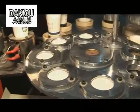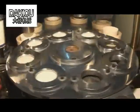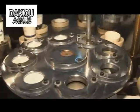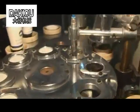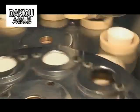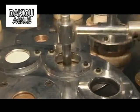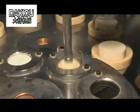The feeder roller transfers the fan-shaped paper to the positioner roller. The left and the right hinge hold the fan-shaped paper to the die head tightly. The copper stick presses the welding, and the left and right hinge separate. The catcher draws the finished paper tube out.